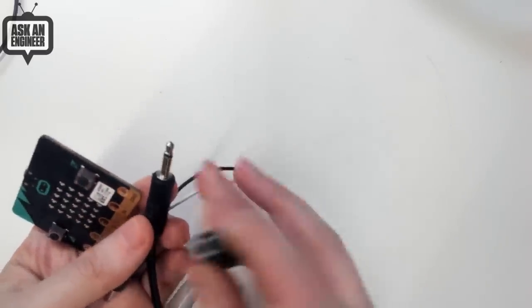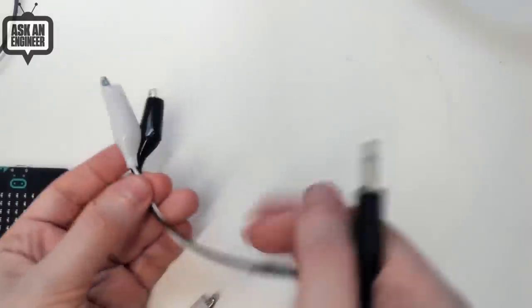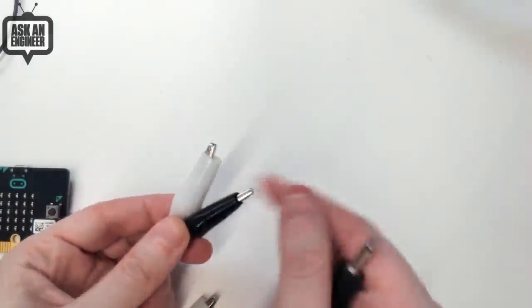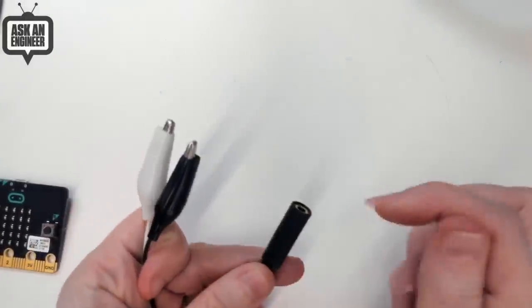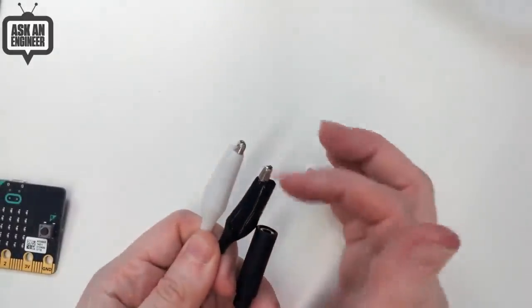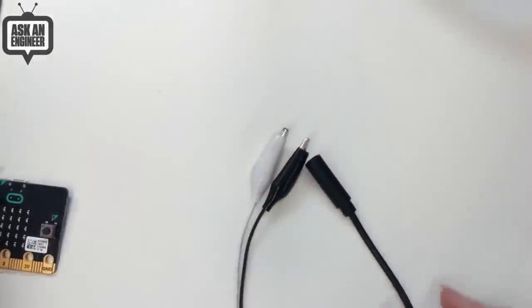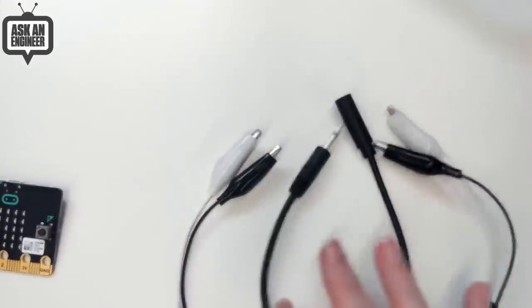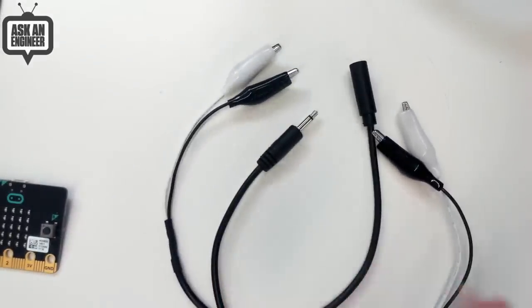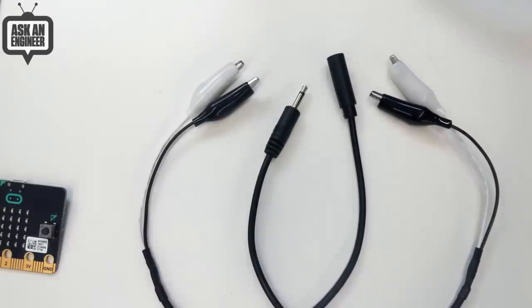And if you're doing accessibility tech and you want to mimic an AT switch, you would use this as the connector, and then these connect to whatever gets contacted together. And if you want to connect to an AT switch, you can plug it into here and then read this from a microcontroller or whatever you want to have activated by the AT switch. So it's a set. You get either one, choose which one you want, choose wisely. And if these become popular and people like them, maybe I'll get a stereo set as well that has 3 cables. But for most people's uses, for audio or AT, I think mono is good.